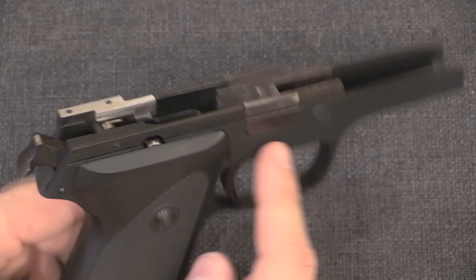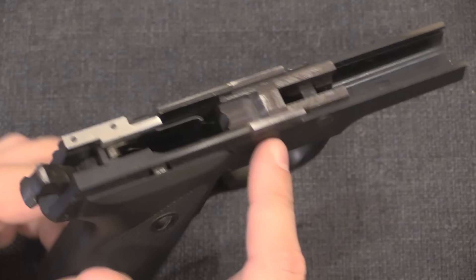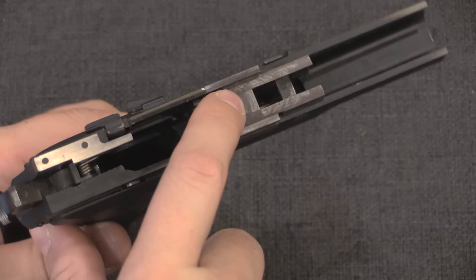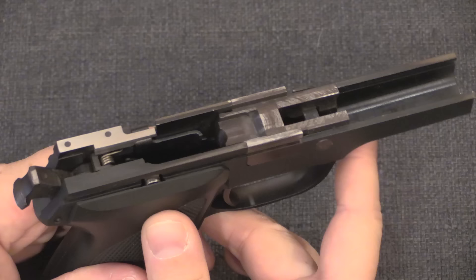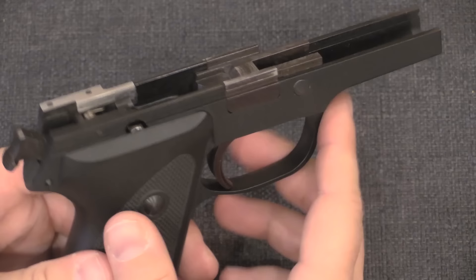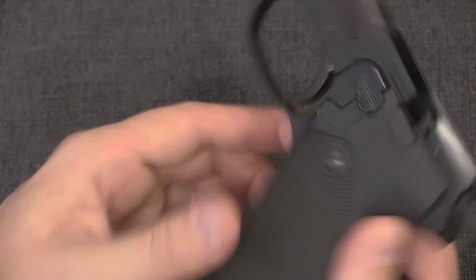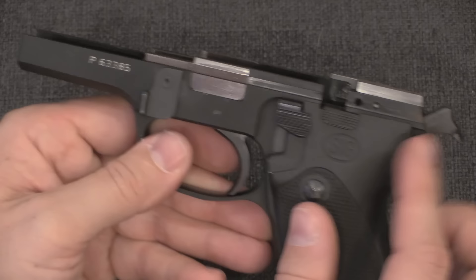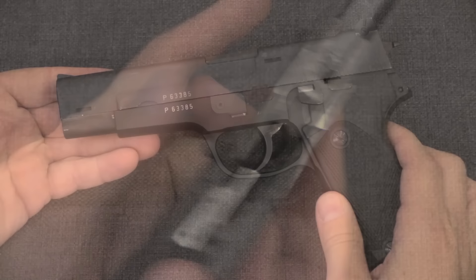In order to make that work with an alloy frame, there needed to be a steel insert. There are actually two steel inserts on this early prototype. You can see one of them right here that has been dropped into the frame — it has a section of guide rail, and it also has the bearing surface that causes the barrel to lock and unlock. That's an important piece that has to be hardened and have good wear resistance, and you're not doing that out of aluminium alloy — hence the inserted steel block. There's a second block at the back that's going to include a fixed ejector. Those are the two main notable elements in this prototype frame, along with a double action trigger and a decocker.